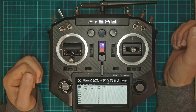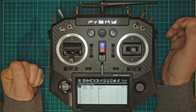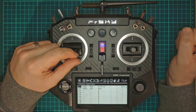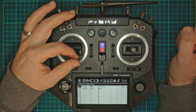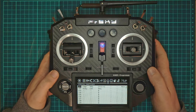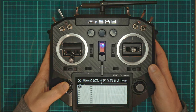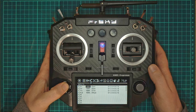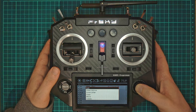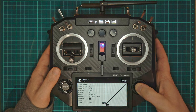What we now need to do is assign that to a channel so that INAV can actually use it. I'll do this for a regular non-flight-controller system first — we're just going to use it to disable our throttle. The way I like to do this is on the inputs page. We'll page back to our inputs, find our throttle input, and edit it to put it on a switch, which is going to be logical switch 2.